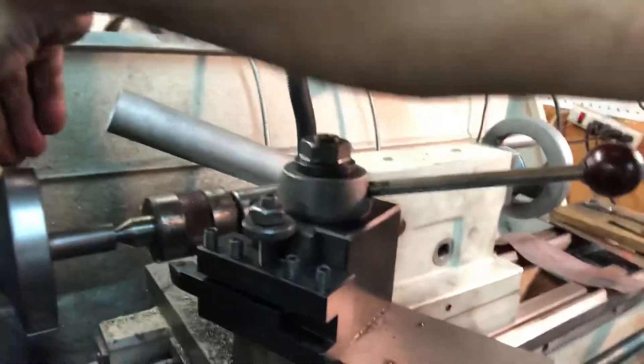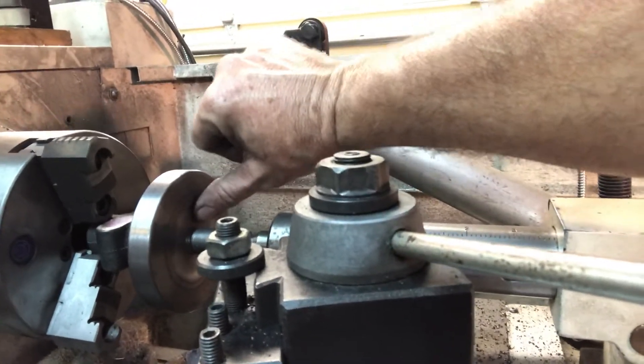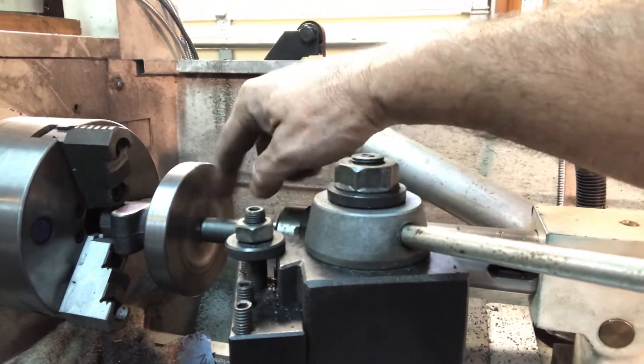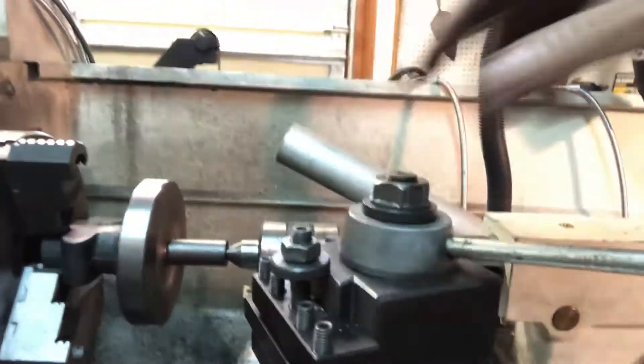That's where we have it today. I'd like to show you what I have in mind. Right now I'm brushing off any of the cast iron dust that might be there. I'm getting ready to disconnect this setup. Under here there's a little undercut as well, underneath the base. The drawings call for it to go to an eighth of an inch, but it was difficult getting a tool in there so I just went to a sixteenth of an inch. There's still a nice wide rim around here that will provide the support. And I'll be drilling three holes — I'm going to mark those in a minute.